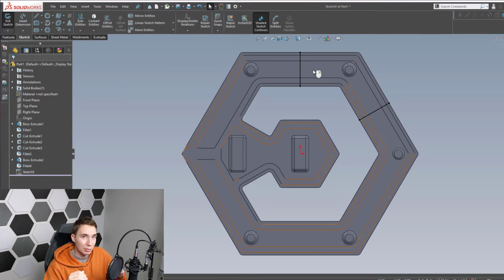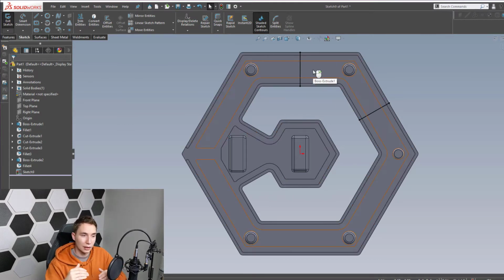So the nice thing about splitting it here with the cuts right in the middle of the sections is that we can add dowel holes into each of those parts so that we can fit little wooden dowels. They're like little cylinders of wood. We can stick those into holes on both of the parts and it'll perfectly align them. Makes it super easy for assembly. And like I said, it lines up your parts. If you get your tolerances right, pretty bang on.